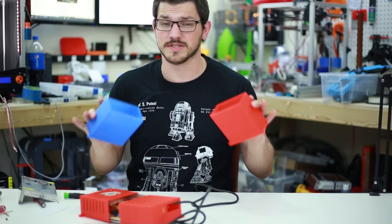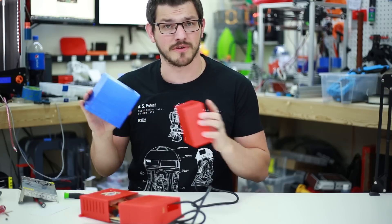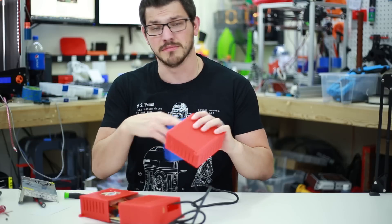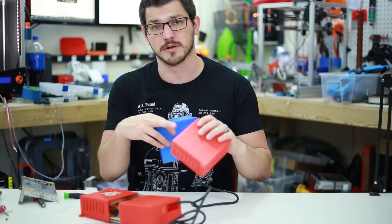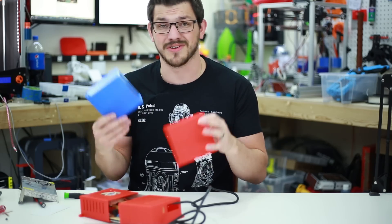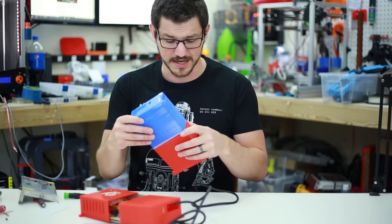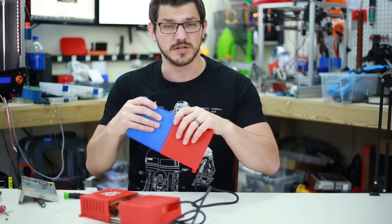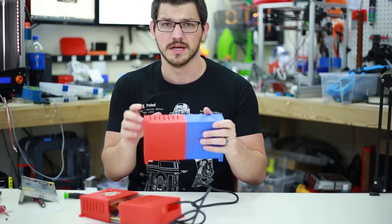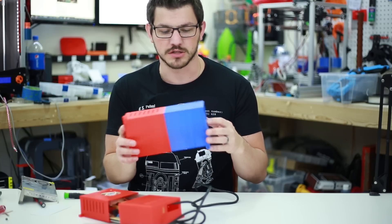I will say the model is super tight. I upsized the model from the original creator — it was a little too tight in my opinion. I gave an extra millimeter all the way around, so an extra two millimeters total across each direction. There's two millimeters extra space in there for a little more airflow. Putting these together is easier when it's already on the power supply, but it is super tight. I think I just need to add a chamfer to the corners to guide it in better. It's really hard to get together at first, but once it's together once, it's pretty easy.